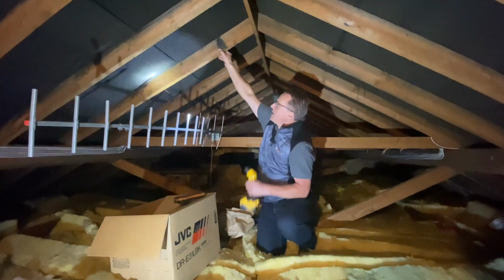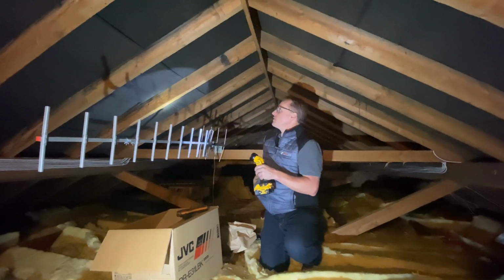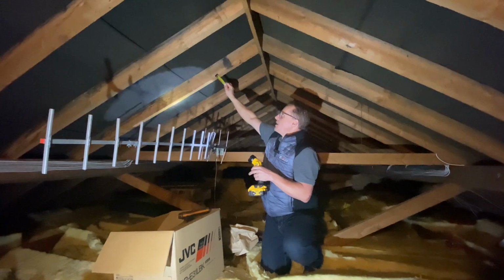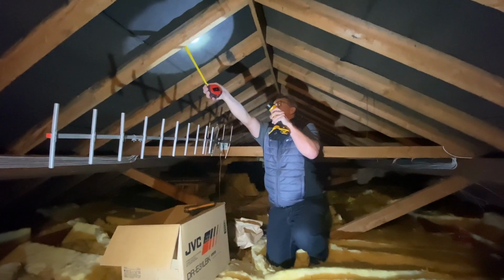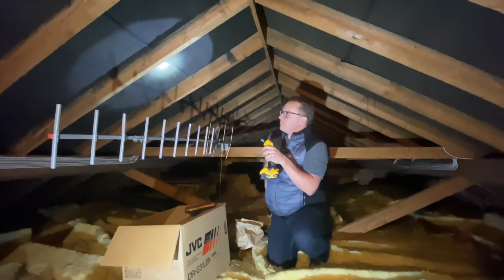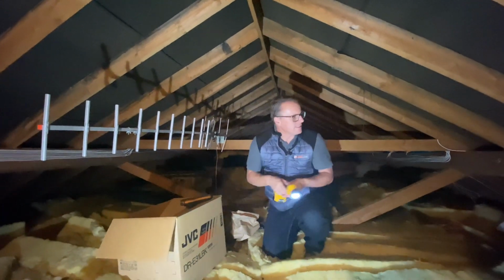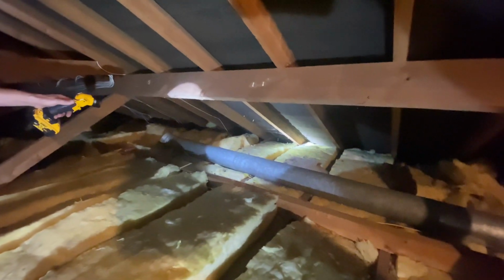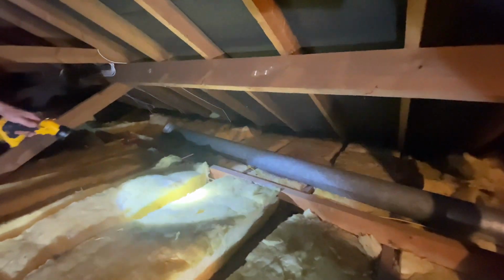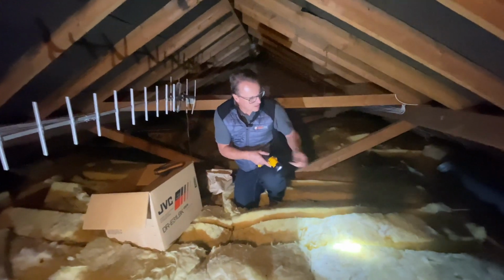Then we've got our rafters. These are the old 4x2 size, slightly less than that actually. They're not quite 2 inches. Looks to be about 38 mil. They are 38 mil, so 38 by, I think 102 was a standard size, so 102 by 38. So that's what, inch and a half, I guess. And these bear down onto a purlin, which runs through the property here, and then onto a wall plate right the way down at low level there. And then off the wall plate, we have our ceiling joists that run in here front to back. They take the ceiling linings from the underside.